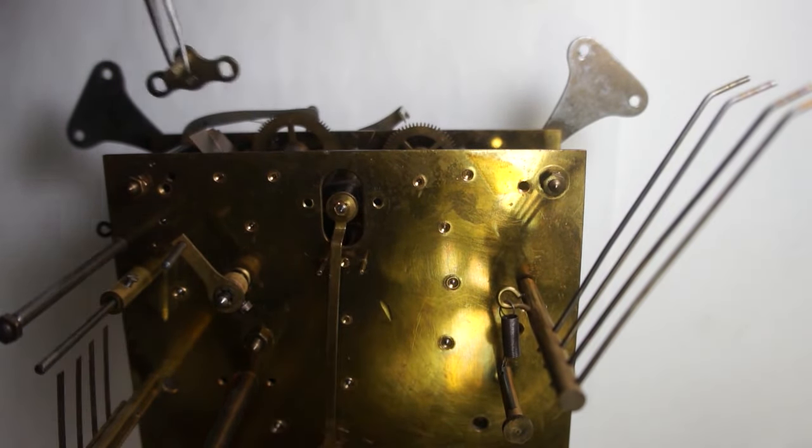So to strengthen this door up so that it's serviceable, I'm probably going to come in here on each of the corners and either run a hardwood dowel through it here or put a pin through it on each corner. And then after that, I will take this panel and re-glue it in there to make it more secure. And none of the miters are tight. They're all loose. The only way to correct that is to recut them, because either the wood shrunk or they weren't cut at a true 45 degree angle. But we'll go ahead and leave those the way they are. We'll try to get this strengthened up so that it's serviceable. So I'll take this door out to my wood shop and get it strengthened up so that it's serviceable again.